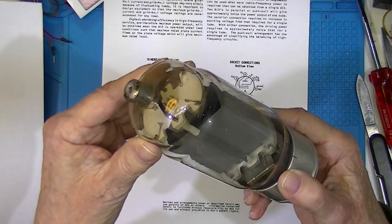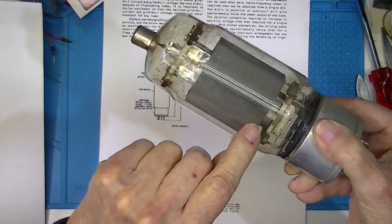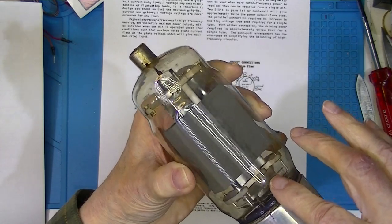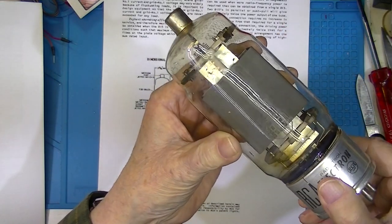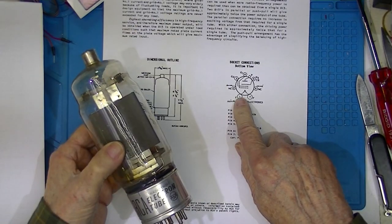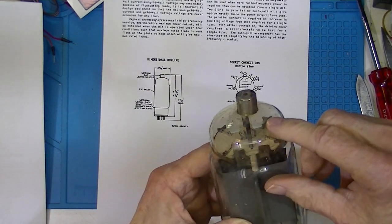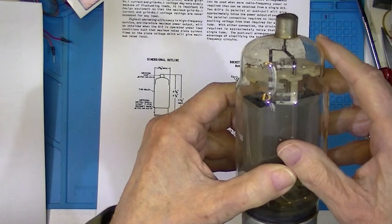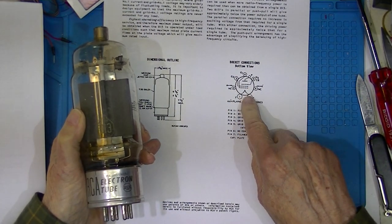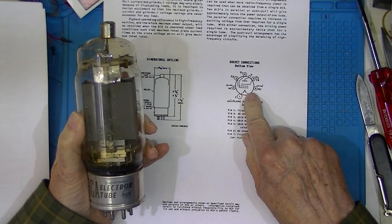There's a large metallic plate — a rectangle with two seams — and ceramic support pillars on both sides. The actual grid structure is hidden by the plate. To maintain somewhat dimensional stability of the heater, there's a pair of springs on the upper end of the tube to apply some vertical tension to the incandescent wire that forms the heating element.